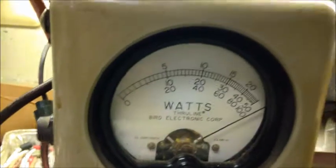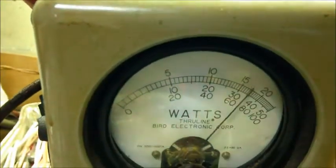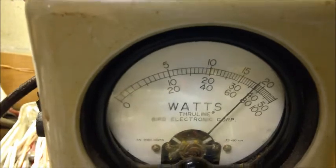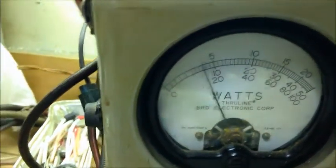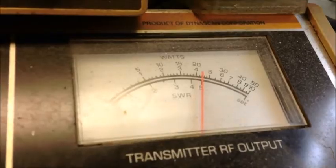13 RMS — oh yeah, and there it is in the corner. So we'll switch this out and put the 100-watt slug in. Watch the slug peak side — a little over 70. And over here on the RMS peak meter — hitting about 55 on the RMS, which is really good for this radio. So there you go. We'll be back with the next unit.